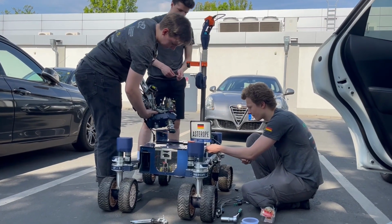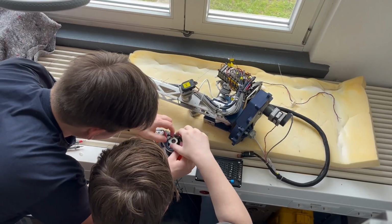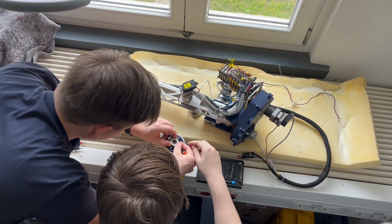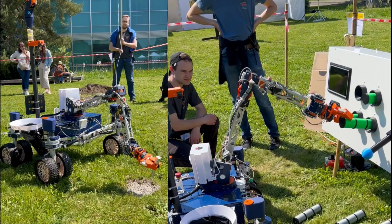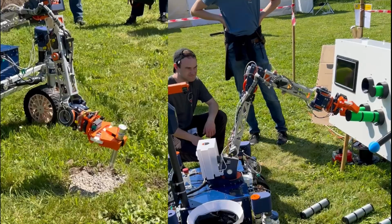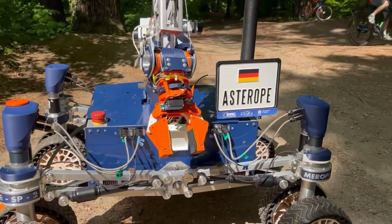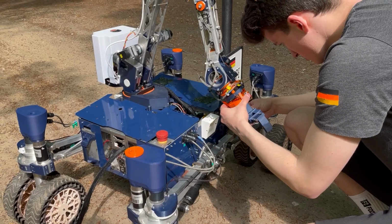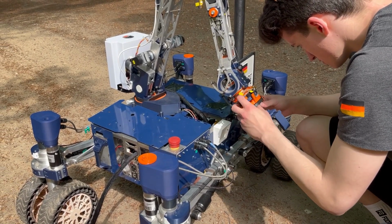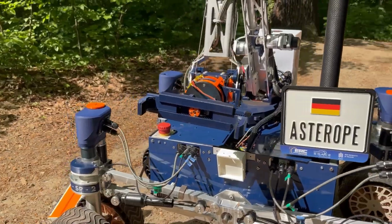Because we noticed our last robotic arm not being as rigid as desired, we redesigned it from the ground up. It retains the structure of being a 6 degrees of freedom serial manipulator with decoupled joints. For most tasks, we will use our general purpose gripper. It can be replaced by the shovel for surface sampling or the specialized maintenance gripper.